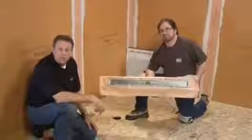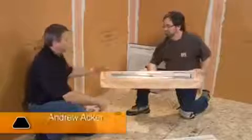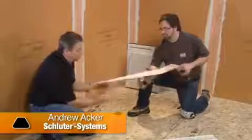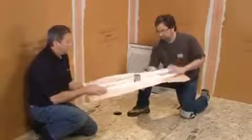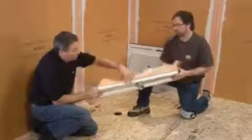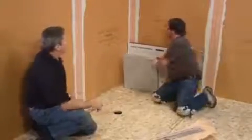What we want to show you is the installation of our KERDI-LINE drain in an intermediate placement. So we're going to use the KERDI-LINE drain. You can see the channel body here. It has the KERDI already attached to the flange. We're also going to use the support for the channel that fits on the underside here. So now our channel is fully supported along its length. It also gets us up off the floor, shims us the proper thickness to make room for our shower tray.